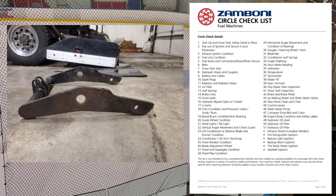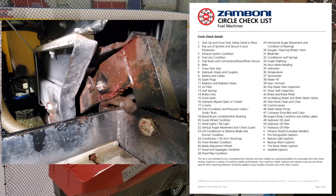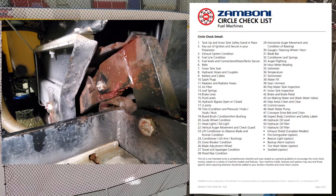Number twenty-four: conditioner lift arm and bushings. Inspect the lift arm; we had to replace it on the 500 because the holes got worn out and there was too much play, which caused waviness in the ice. Once we replaced it the waviness went away. Grease the six bushings (three on each side) once a week and replace them every three years for a 12-month operation or every five years for a six-month operation — you don't want slop damaging your conditioner.